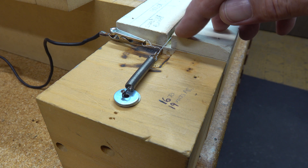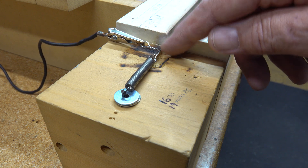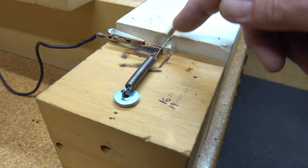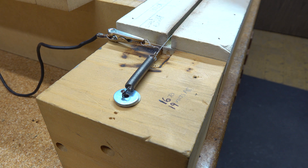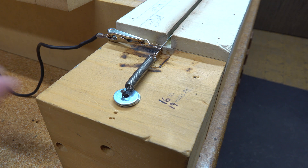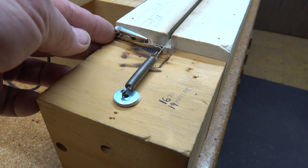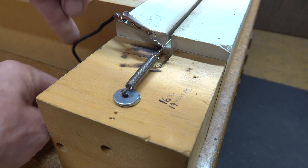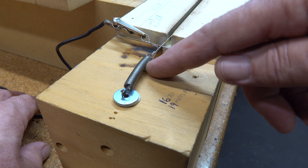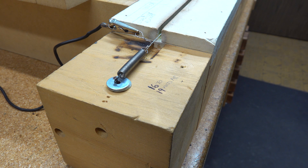The other thing to watch is how the wire sits in the track after clipping. You can see it's pulling on the wire — you can't have that. Do whatever it takes to manipulate the wire outside so it can float while connected. Right now it's floating because the spring holds it with light tension and you can see it bounce in the slot. You might need a small nail, clip, or something to keep it from moving around. Once it's hooked up correctly you don't have to mess with it again.